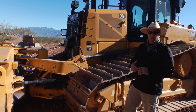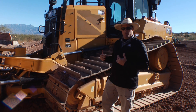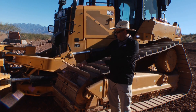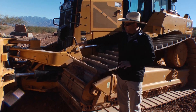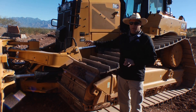One of the other things we did was we took a lot of the weight off the front end of this dozer and moved it back. The redesign of the C-frame — splitting that C-frame into two C-frames, the lower and the upper — allows us to get a bit more of a horizontal load path in there, and it allowed us to make this material more efficient up here. So this is not only a stronger C-frame, but it's also a bit lighter.